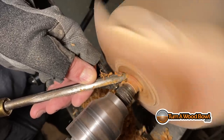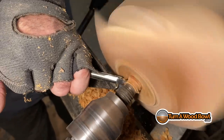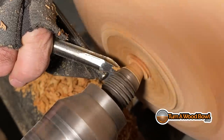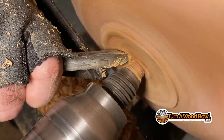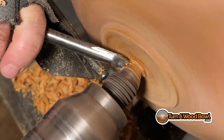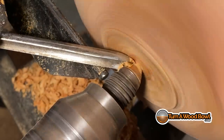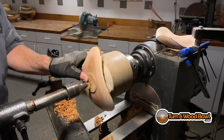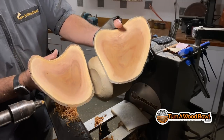I've switched to my 3/8-inch spindle detail gouge to continue shaping the inside scooped-out portion of the foot, then start reducing the little nub that's holding onto the tailstock. Just making angled push cuts in towards the headstock and nibbling this down. If you're not comfortable doing this you can stop and cut that off with a knife or a small saw, or sand it down. What I like to do is come in here, make a cut across, then rotate the spindle detail gouge into that little V-shaped nub and sever it off. I power off the lathe, turn this by hand, and it cuts through those fibers and removes the little nub. I'll still have a small portion to sand off, but it's really easy to deal with. Now we've got both pieces completely turned.